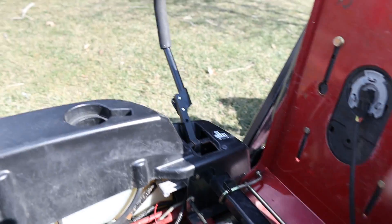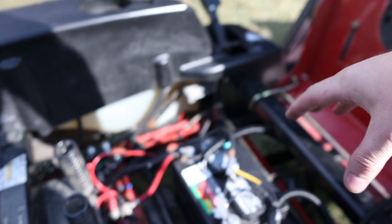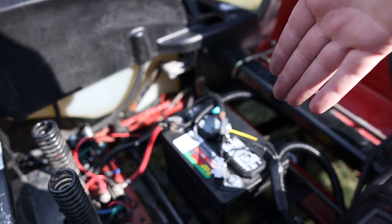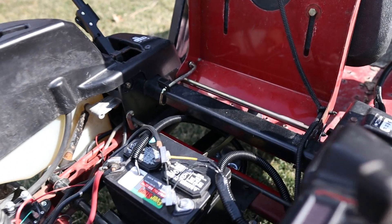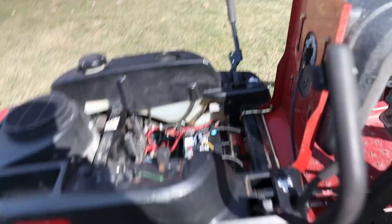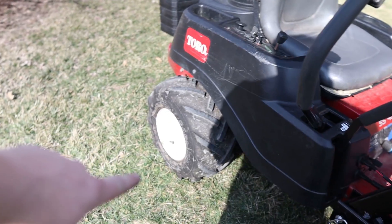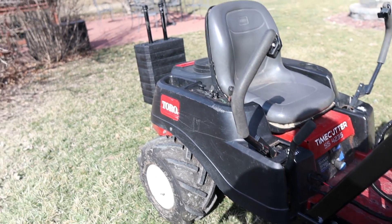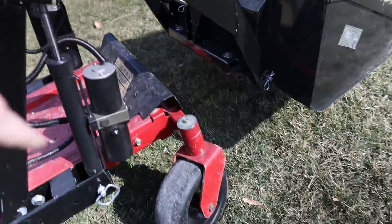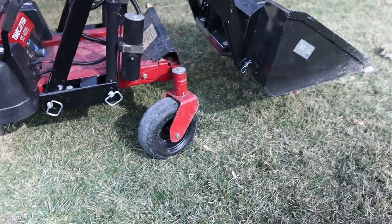You could get away without the alternator if you got a bigger, maybe marine-style battery that can handle the deep cycles. These little lawnmower batteries do struggle a little bit. My suggestion would be to always have the engine running so it's charging the battery. I also upgraded the tires — the original turf tires slipped quite a bit if the grass was even slightly wet. So I upgraded the front wheels and tires to no-flat solid tires up front, so I don't have to worry about those.